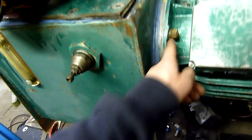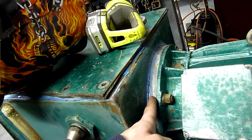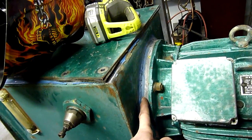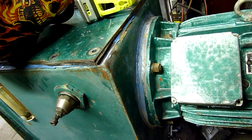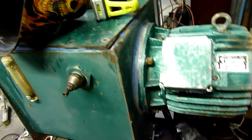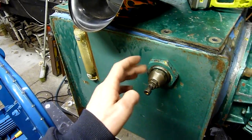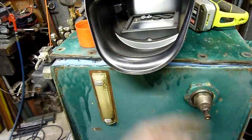Hydraulics can wait for the time being. I'm not sure whether I'm going to tear this completely apart for parts, because it's got a really big pump in it. I want to see how this motor comes off and whether this part of the housing is wet. If there's oil inside this part of the housing and the motor itself is completely sealed, then it's not going to be so practical as a whole unit. But if this thing here is like a sealed bell housing, I could probably leave the bell housing on — assuming it's bolted on independently — and run a drive shaft into the coupling. I'll couple it up to the Yanmar diesel all on its own. That way I can take that piddly little PTO pump off it and actually use this thing, which has almost one-inch outlets on it. Most of it seems to go through this bypass valve when it's running.